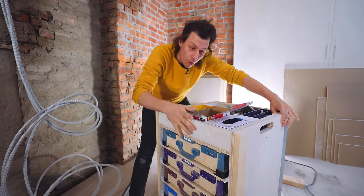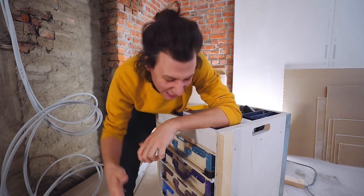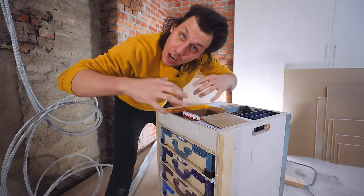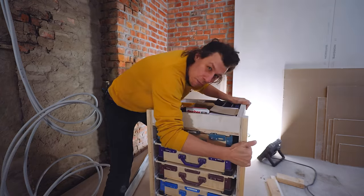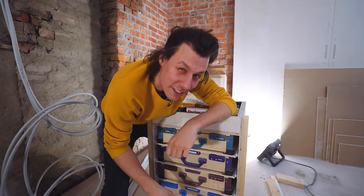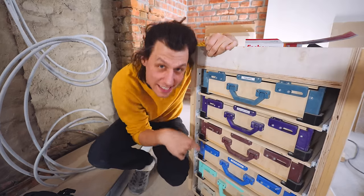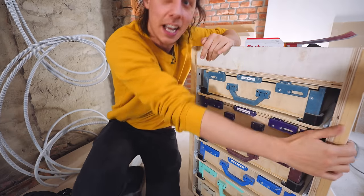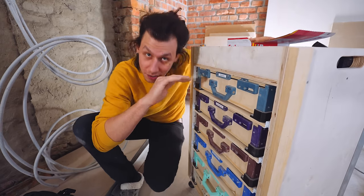One quick note though: when I built this I unfortunately used really crappy plywood that was pretty warped. Since the sides were bent they bowed out a little bit, and sometimes on the middle ones the drawer slides would fall out of their tracks because the distance in the middle was wider due to the bent wood. To fix this I just attached another strip of wood to the side to stiffen the whole thing up — now it works great.